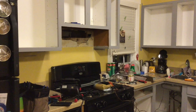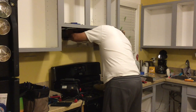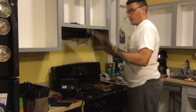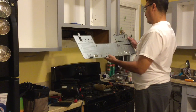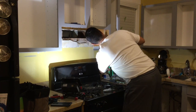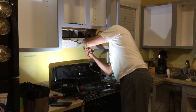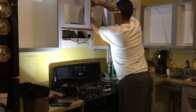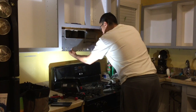I recommend you get an electrician to do the outlet install — I did it myself and I'll show you in another video how to install an outlet. Now that it's installed, we take our template — which is also the aluminum backing plate — and mark our holes into the cabinet. The first hole is for the electric to go through, and then two holes at the front to help support the microwave. The cool thing about this unit is all the instructions are printed on the backing plate, so you don't have to go back and forth to a separate paper sheet. Now that we have our marks, we drill the two front holes, then drill out the electrical hole using a paddle bit — I drill partway through, then finish from inside the cabinet so that side is clean.